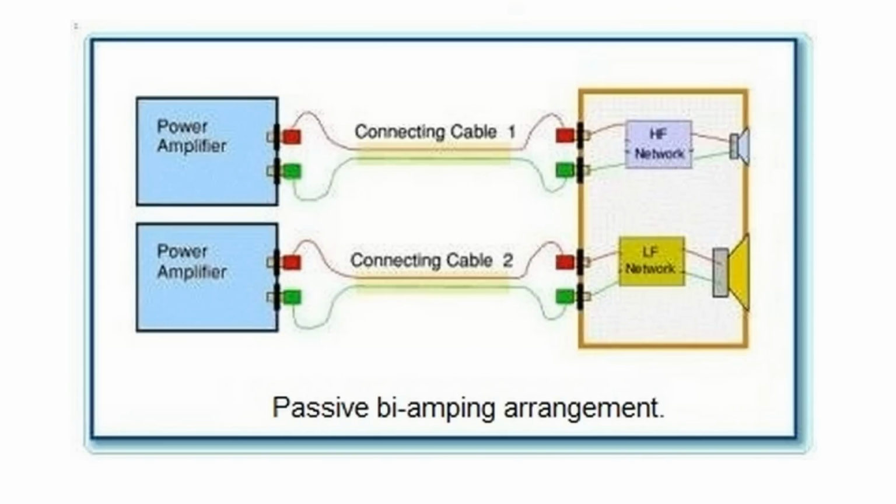Now, some people say passive biamping is a waste of time, and I say, you know what, that's not true, because there's excellent situations that I've done passive biamping that have really worked. Situations where you have a giant tower speaker, like our reference towers, for example, that have true subwoofers in them, not the crap that claims it plays down to 20 hertz, but speakers that play to 20 hertz at meaningful output levels. There's situations where you might want to run the lows as an LFE channel or a sub channel. And, you know, especially since they're right underneath the satellites, you could run them as stereo bass. So you could cross them over higher. And if you cross over a speaker higher and you're doing stereo bass, you get that better transient effect that you don't typically get with a small subwoofer satellite system. So that's a case where passive biamping can really help.